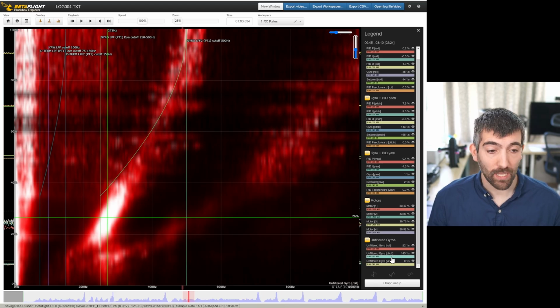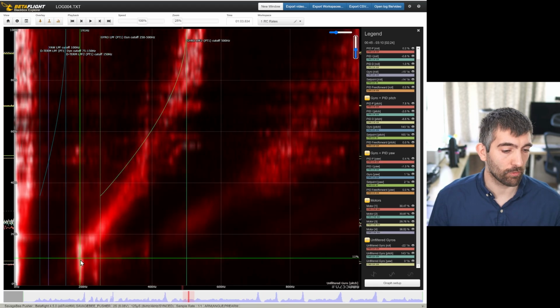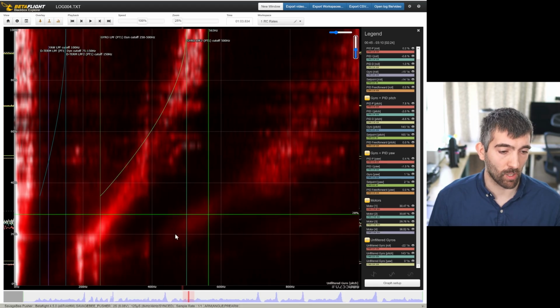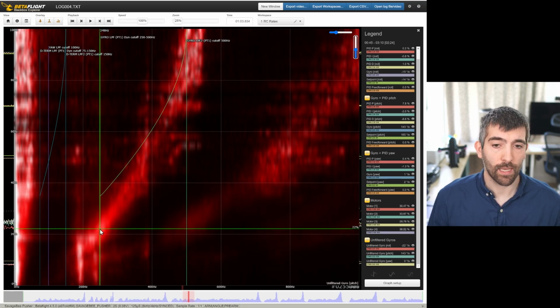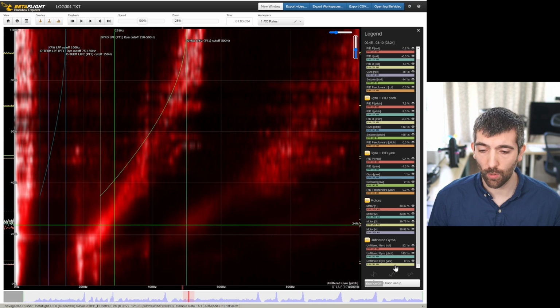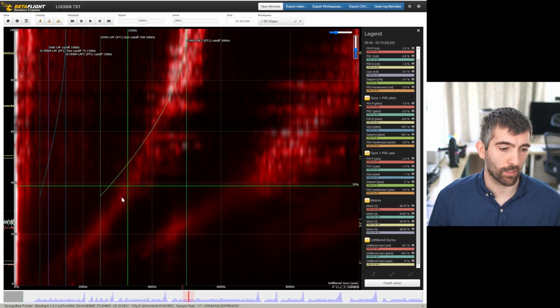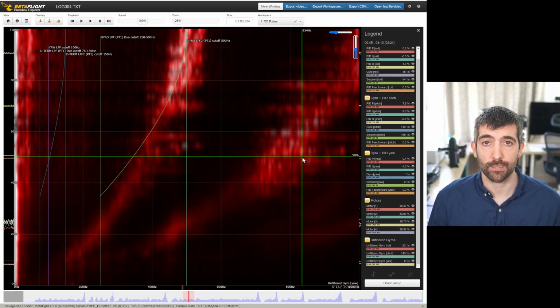If we look at the pitch axis, again we see maybe a little frame resonance down here at about 190 hertz. Again, the 2 broad sweeps of motor noise, and maybe another little resonance at something like 240 hertz. But yeah, overall this is still pretty quiet. And on the yaw axis, as we would expect, the flight controller is well mounted. This is nice and quiet, and we don't see any example of frame resonances.